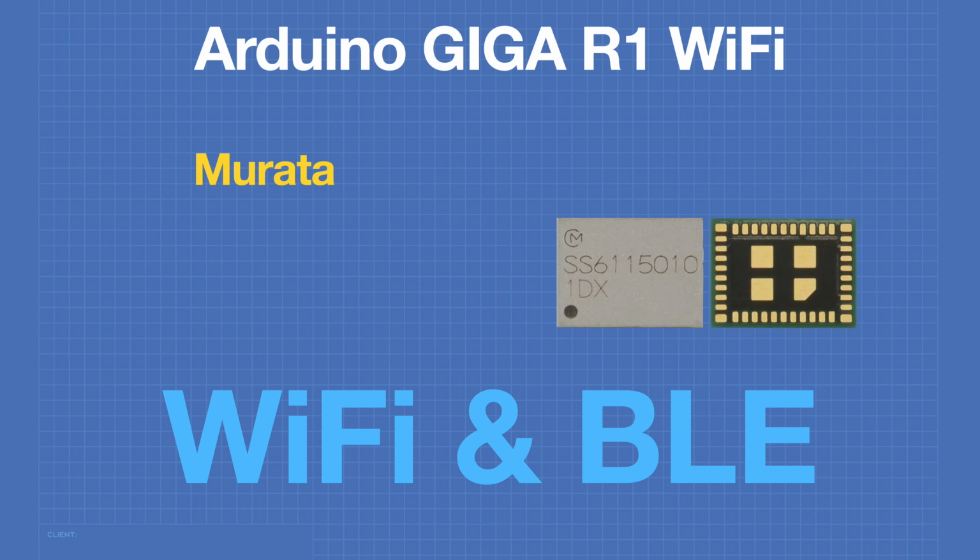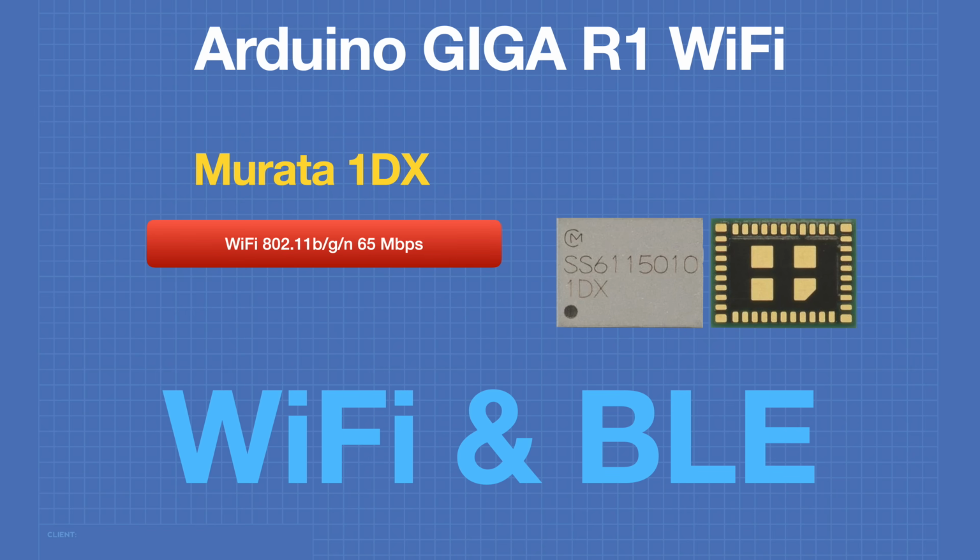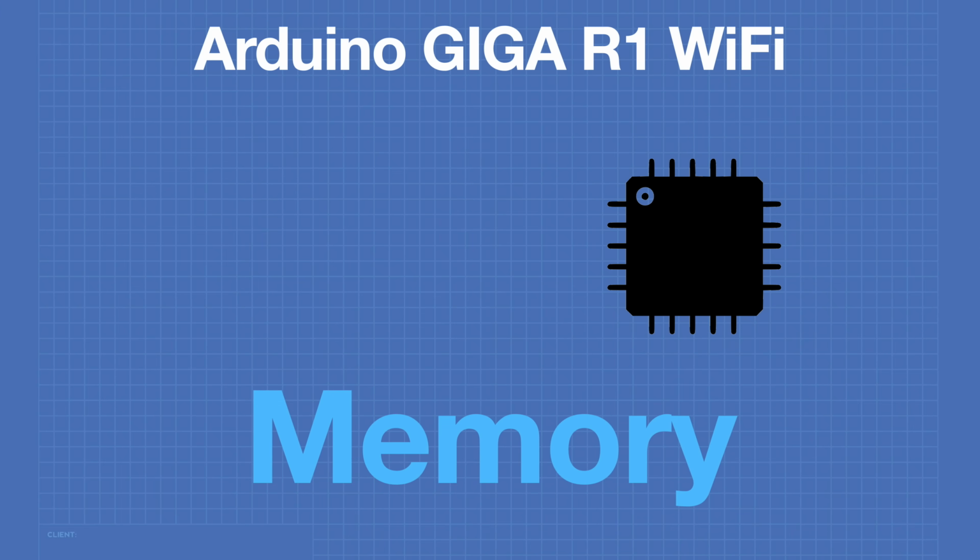Wi-Fi and Bluetooth capabilities are provided by a Murata 1DX module. The Giga has Wi-Fi capabilities up to 65 megabits per second. It also supports Bluetooth Low Energy version 5. You should note, however, that with the current version of the Arduino IDE, you'll only be able to use version 4.